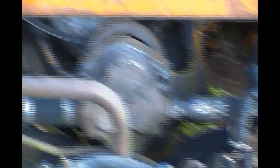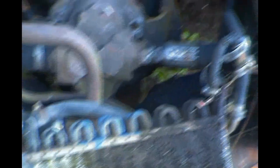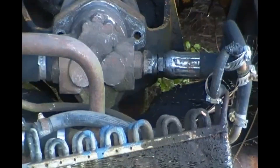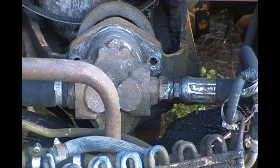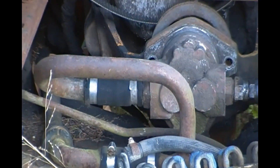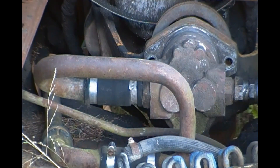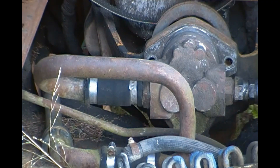If you notice on the right, there's a pressure hose. That means when that pump is pumping, you've got high pressure coming out the right side as you're looking at it. So that pressure hose has to be removed because the pump has to slide forward. Over here is what you call the suction line — it's not under pressure, and basically it runs straight back to the hydraulic storage tank, maybe with a filter between.